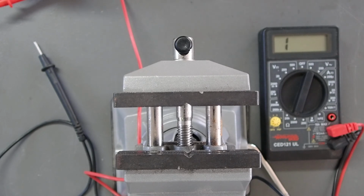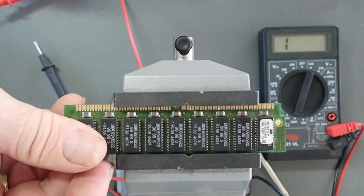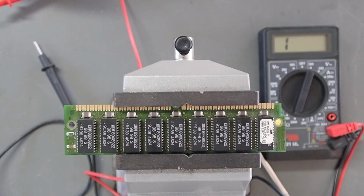Now in this case, I'm trying to work with a Model 70 that is actually what they call the AXX planar, where the CPU is in a complex above the planar, and it can be upgraded to a 486 unit with the correct module and BIOS chips that you change out. So the system only recognizes a 2 megabyte capacity, 80 nanosecond speed module. And right here, what I've got in my vise is the correct module for that. I only have one of these.